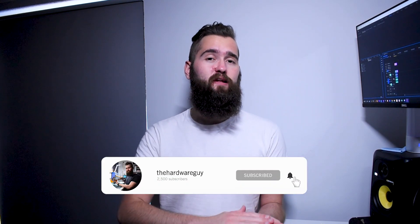Welcome back to another video. Today I'm going to show you my first 3D relief carving on my upgraded 3018 CNC router. I'll be taking a free 3D relief from TurboSquid and importing it into Fusion 360. From there we're going to generate two tool paths — a rough cut to clear out the majority of the material, and a finishing pass using a V-carve milling bit. I'm using completely stock settings in the Gerbil software, so this cut will set the baseline from where we can improve over the next few weeks and months.